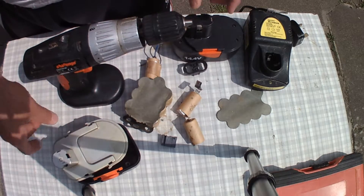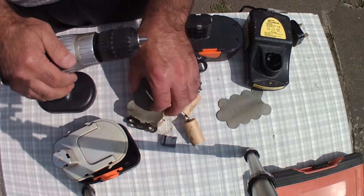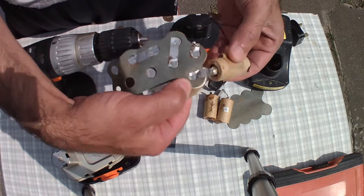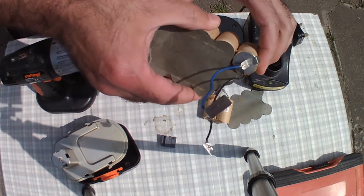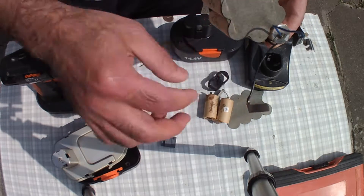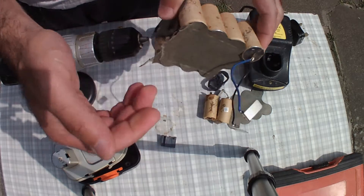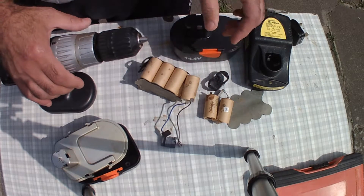All you have to do is take the good batteries out very carefully and gently without tearing — if you force them out these plates might snap or cut your fingers. If they're already charged you have to be even more careful, because if the wires touch each other they can cause fire. The batteries get short-circuited, can go very hot, burn your fingers, because they have a lot of current in them.